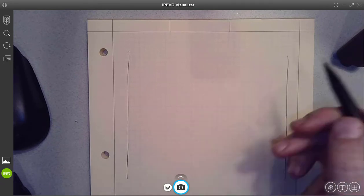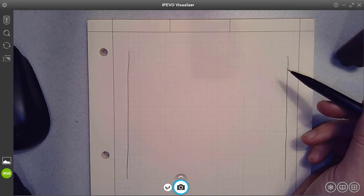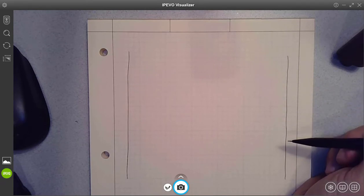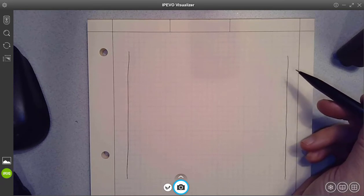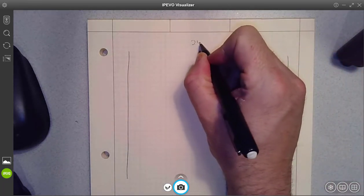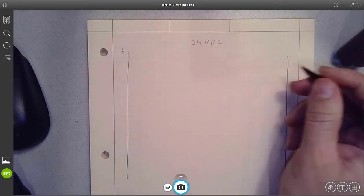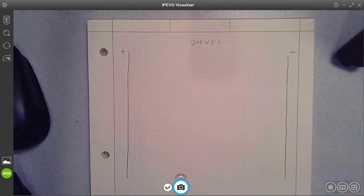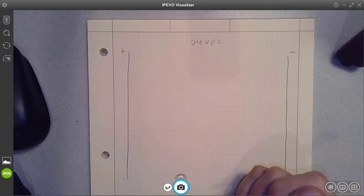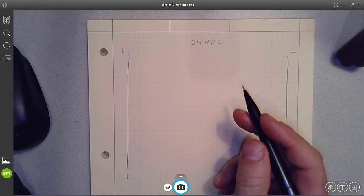So outputs on a control ladder diagram might be things like relay coils, indicator lights, coils for motor starters, things like that. It's not going to have the actual motors themselves or solenoids or things like that. This is going to be lower control voltages. So this might be like a 24 volt DC supply represented by these rails. So if it's a 24 volt control source, then typically this would be the positive rail and this would be the negative rail. Or if it was AC, they would just each be line 1 and neutral or something like that. So if we think back to how our little trainer just behaved, let's talk about the green lamp first.